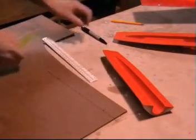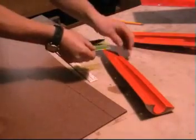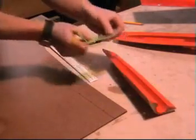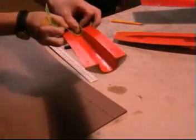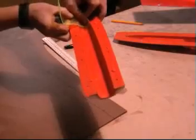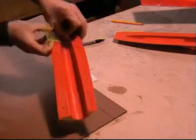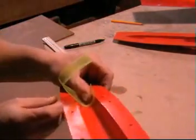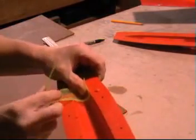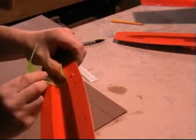Then we take a nice flexible ruler. The first station obviously is 0, and then 2 inches in, measure the mould. Just hold it down tight to the surface and measure it off. I got this out of a Christmas cracker — nicked it from my niece. Hope her mum didn't find out. Measure that, and then transfer onto the hardboard at that 2-inch station.